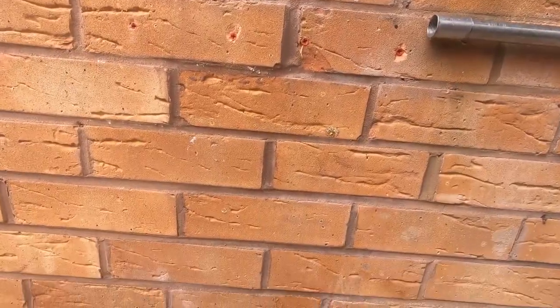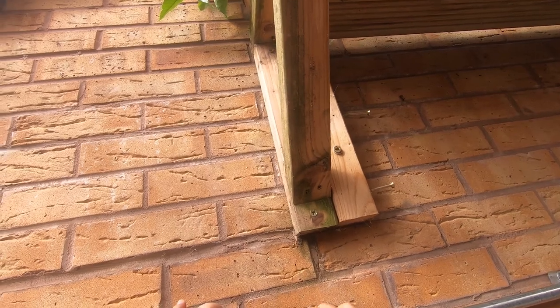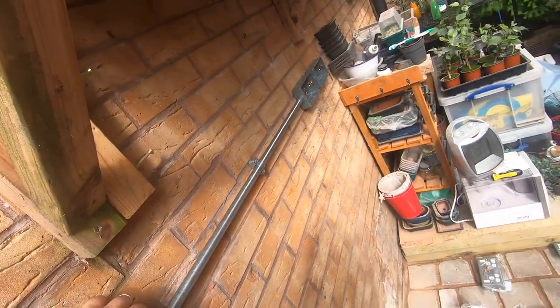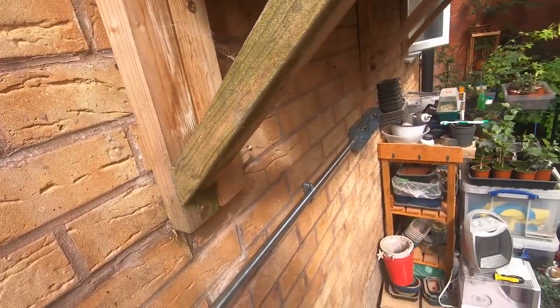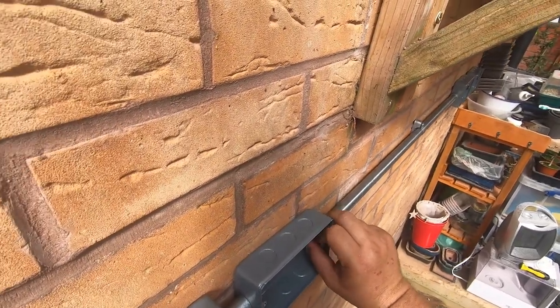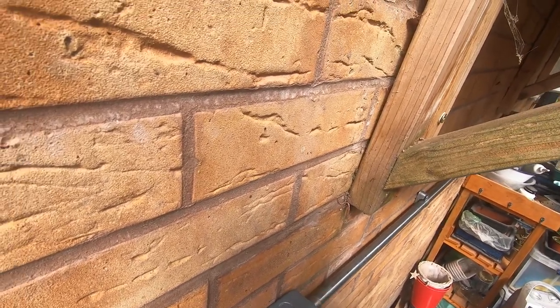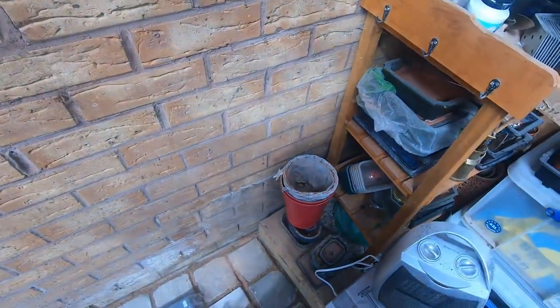We'll put our brass bush back in, and then marry it up at this end. Brass bush just screwed into place. They used to position these top and bottom at the ends, which made it quite a bit easier to get your fingers in and fasten, because you had a bit more behind these threaded connections. We'll get our bush tool.